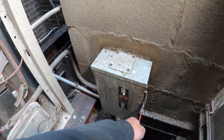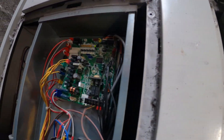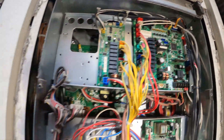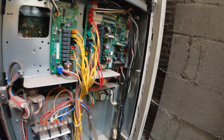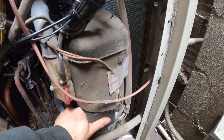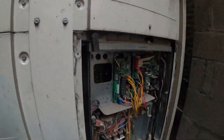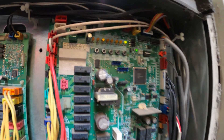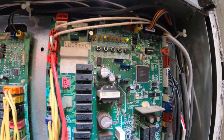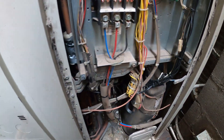Let's turn the power on and see what's up. We've got some flashing lights. I closed up the cover, went into one of the rooms and set the thermostat to cool — and it is responding. That compressor is running and the fan is running. Let's see if we get any cold temps. In the original visit we did have a bunch of green lights, but we had two orange lights — I think it was H2P and H3P. We only have one of those lights on now and it's actually running, so that is a good sign.